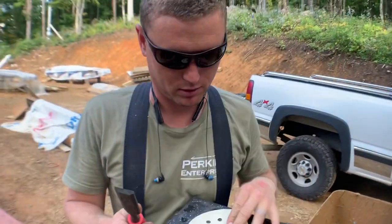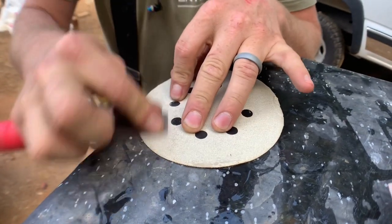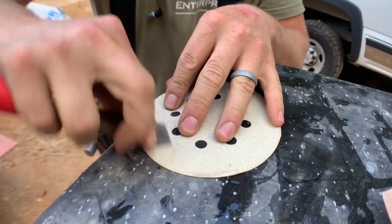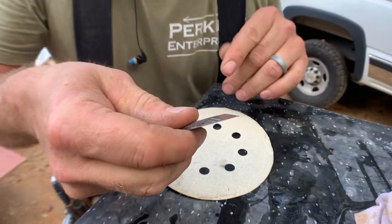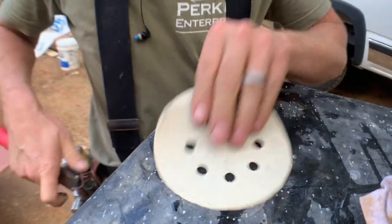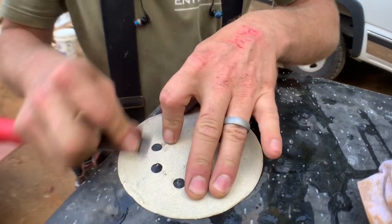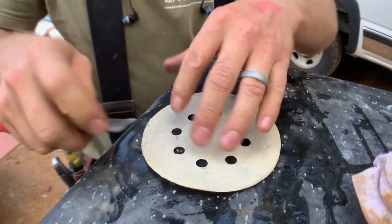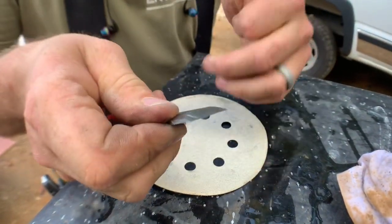We deer hunting or working out here? Let's just say you're a desperate carpenter — sometimes you don't have a grinder and you don't have a honing stone, but you might have one of these: sanding paper. Let's try that. Do the back, do the front. That actually looks pretty good — that might be sharper. Let me rub on that a little bit more. This surface is not flat at all, but I would say do it on something flat. Looking sharp to me — I'd take that any day. Not bad.